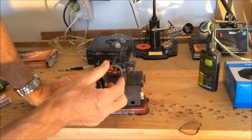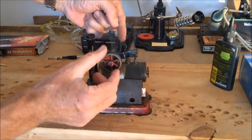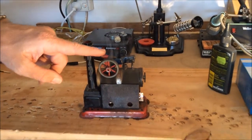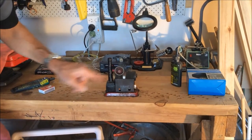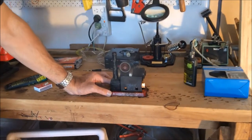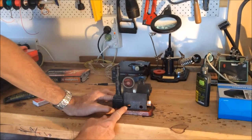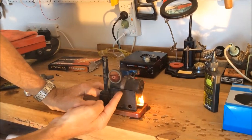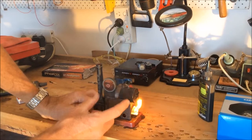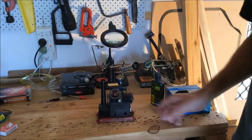We should be starting to get a bit of pressure in the boiler now. If I move the flywheel so the cylinder is in the up position — you can see how it kicked! I think we've got enough pressure now. If I give this a flick — there we go — the steam engine is working! In terms of energy conversion: the chemical energy inside the fire starter converts into heat energy as it burns, that heat energy transfers into the water and converts it into steam which creates pressure, and that heat energy in the water is then translated into kinetic energy.